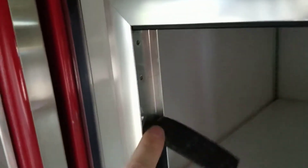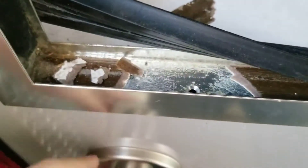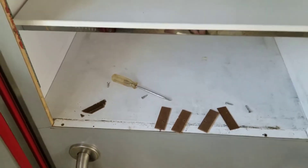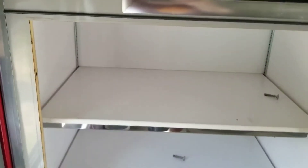For this side I was able to be a little smarter — I just peeled the foam pad far enough to get to the screw I needed, and did the same thing at the bottom by moving the foam aside. I got the last upper screw out, the whole bottom is now loose. Once that final screw was out, I took the whole frame out and the sliding doors are removed — the frame came out in one piece, which is really nice. It had some little shims around it that I'll save, as I might reuse them when I reattach the panels somewhere else.